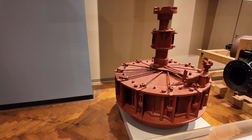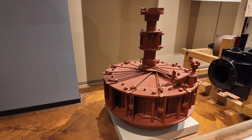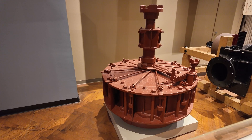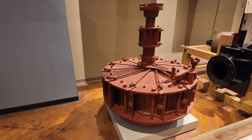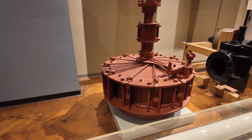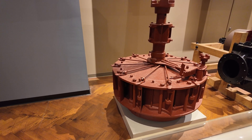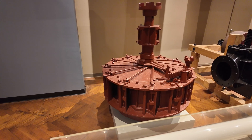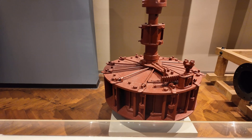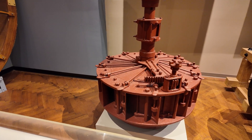Here we have the next innovation. This was invented in 1849 by a British-American engineer, James Francis. It's the first modern water turbine and actually remains the most widely used water turbine in the world today. This one uses something called the American system, where the water sits on the outside of the turbine, and by opening the gates — controlled by that little knob near us that opens all the gates simultaneously — water flows in, rotates the turbine, and the water exits through the bottom.